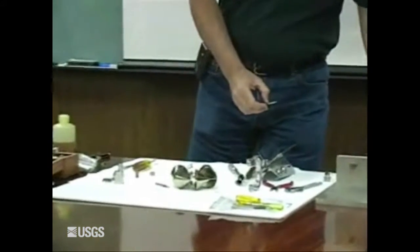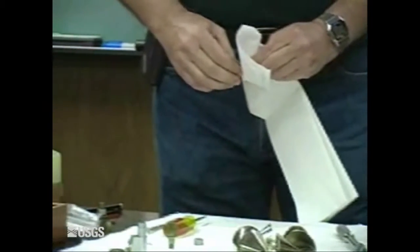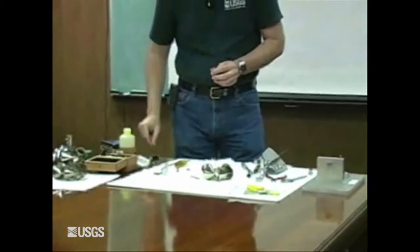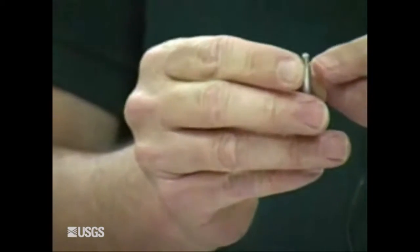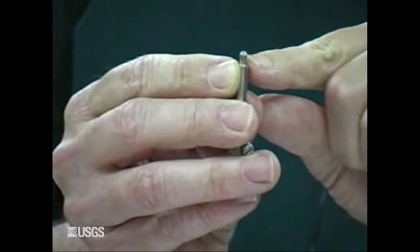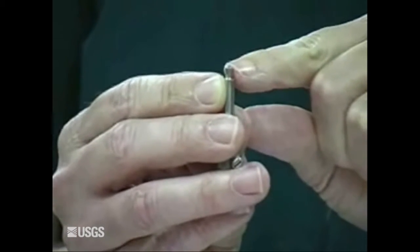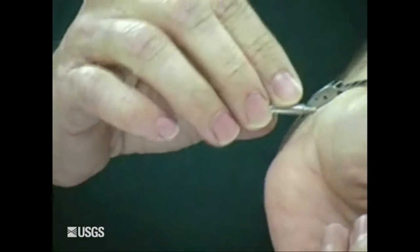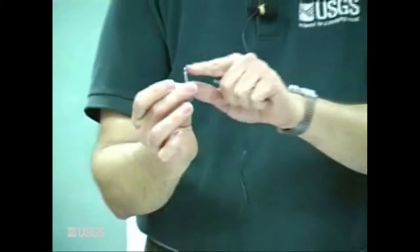Take a pivot and wipe it clean, then inspect it. Here's one pulled off a meter that came through our lab. It's flat, and this one actually does have a burr on it — you can't see it but you can feel it with your fingernail. If you have tender skin on your wrist and rub it, you can feel that burr catching. This one is actually a bad pivot: it has a flat point and a burr.